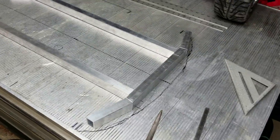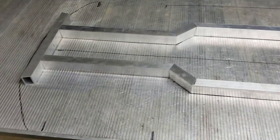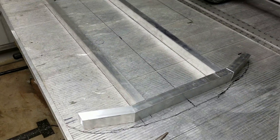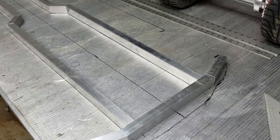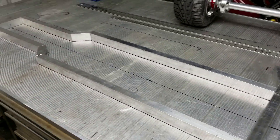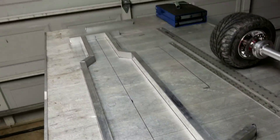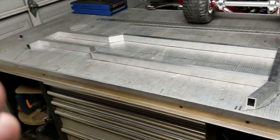So there are some of the pieces cut and laid out ready to go. The next step is to tack them all together, grab out the TIG welder, and just start tacking them temporarily. Then I'll begin cutting some of the cross ties and various components before I finish weld the entire frame. Hoping to have the frame pretty well finished this weekend.